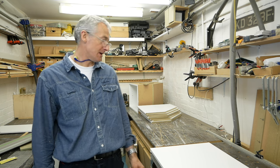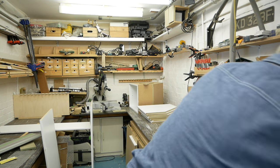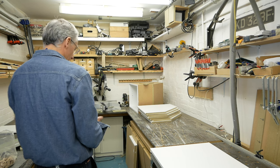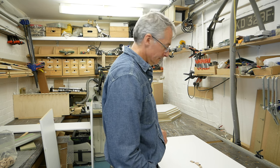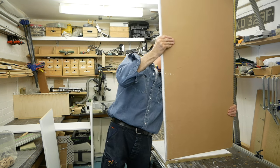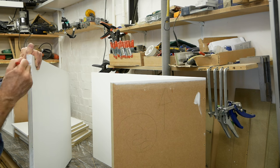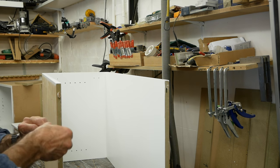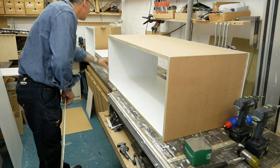Unfortunately, part of my bad day continued and I managed to record some of this without sound. I also lost part of the video of the build, as well as a couple of the sections of the install — so not one of my finest hours, and I hope this voiceover goes some way to explain what's going on. Basically, I've already built the single angled carcass; it went together without any dramas just like the dry fit, and that's been moved to one side so I can make the top boxes. Here I'm working on the double top box — again a straightforward build: dominoes for alignment, plenty of glue and a few screws, with the backs simply stapled in place.